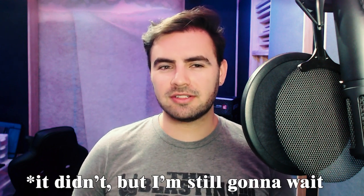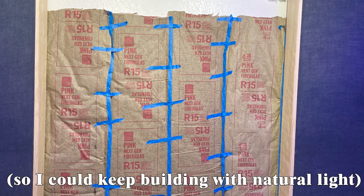Next, the window — one of the larger areas where sound gets in from outside. The plan is to get a single large piece of laminated glass to create a sort of plug that will be framed and fit inside the windowsill in front of the window. This is one of the most expensive parts of my build. However, the current window is already scheduled to be replaced, and there's a chance that process may alter the dimensions of my windowsill, so that's going to have to wait. For now, I've just filled the window with pink R15 insulation to seal it, and it's working wonders — honestly better than I expected, considering how poor the current window is. If you have a window you want to record in front of but outside noise is a problem, and you don't mind covering it, this is a fairly cheap, quick, and very effective solution. It's pretty windy outside and I'm pretty sure there was a parade today, and I've got none of it coming through my window.